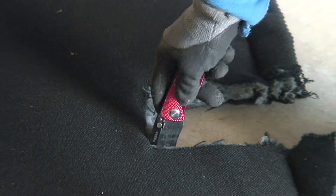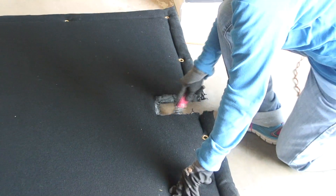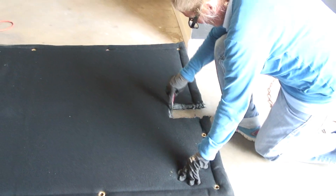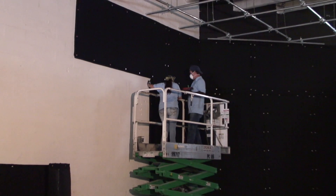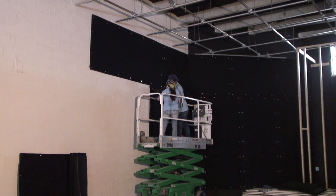The video also deals with making cutouts on your Acoustic Quilts for electrical outlets, switches, phones, etc. Making these cutouts requires a tape measure, scissors, a metal square, and a utility knife. The process consists of measuring the wall and probing to find where your cutout needs to be, cutting the insulation material out of the back of the panel, then cutting the fabric on the front of the quilt.